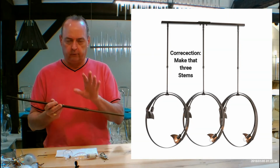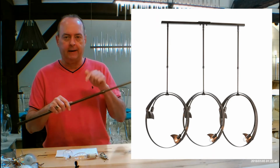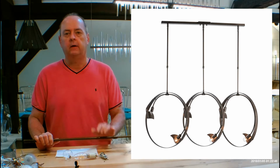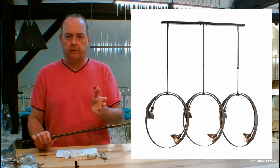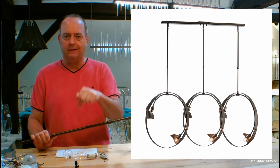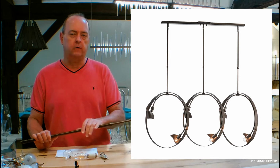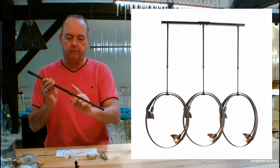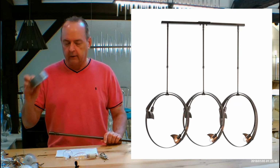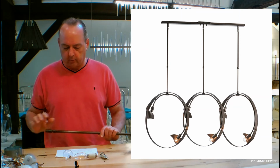So a good way to show you what I'm talking about is look over on the right-hand side of your screen, scroll down a little bit. If you're on the page for this fixture, you're going to see a link. It's going to say, click here for installation instructions, PDF. Click on that link. A big set of instructions and drawings are going to pop up, and those are the drawings and the instructions which will be in the box when you buy it and it comes to you. Those instructions have great technical drawings, and it's going to show you how this whole telescoping rod system works, all the parts. It's going to show you how that canopy works and how it attaches to your ceiling, how it's going to go onto your one junction box, 4-inch junction box. And those are really good details you should know.